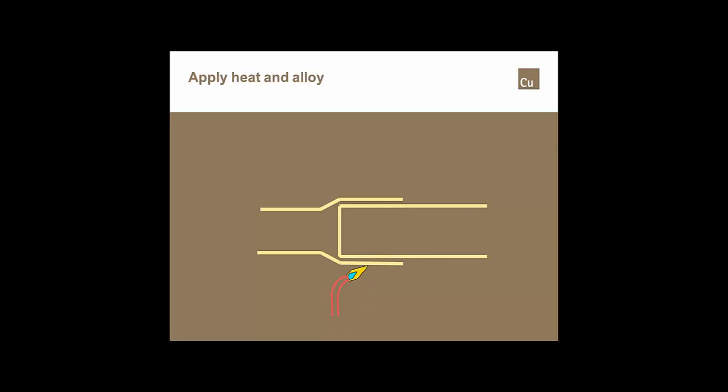The other thing is the position of the torch. It needs to be understood that around the outside of this flame there is a secondary air. It's actually drawing air around the outside of the flame, especially with the swirl tip type torches. They have a very, very high flame velocity. They'll draw a great amount of air around the outside of them.